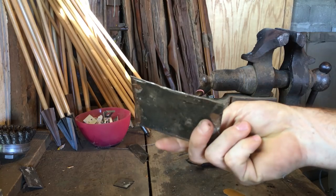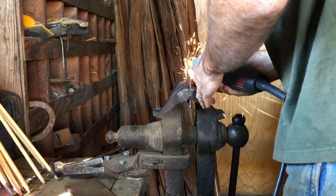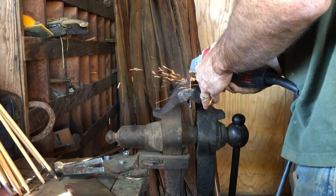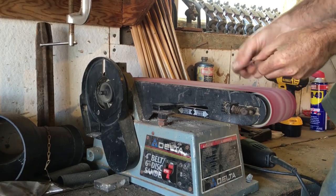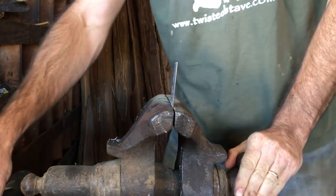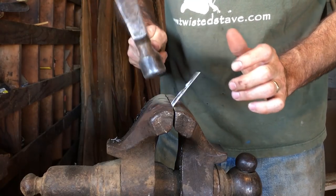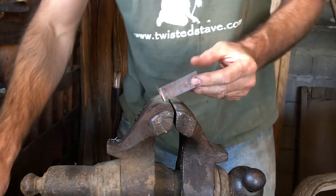For the part that holds the clicker, I had a piece of scrap steel — about 18 gauge, roughly a sixteenth of an inch thick mild steel, so you can bend and fold it over. I cut that piece of scrap steel about five-eighths of an inch wide — that's not critical — and smoothed the edges on the belt sander, then bent it over into about a 90-degree angle on the last half inch or so.